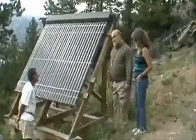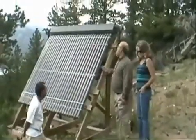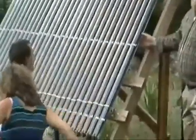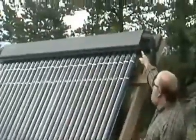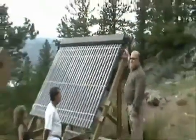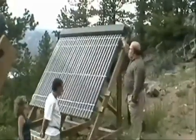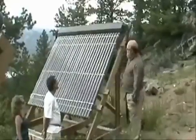She wants to know how these work. These are hot water solar collectors, but the hot water doesn't actually go through the tubes. It only goes through this header up here. There's a copper fin that's in the evacuated tube, and the copper fin gets hot and goes up to a copper diode that's in this manifold. The water — actually a water-glycol mix — so it's a closed loop, so we don't have to worry about it freezing. It goes up into this manifold and takes the heat that way.